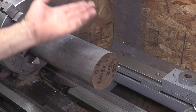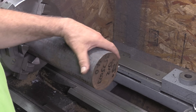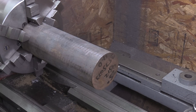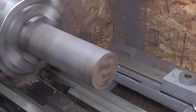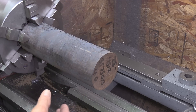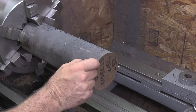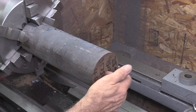This was dialed in to within about 15 to 20 thousandths. It's not really round. Give it a little turn here and that actually looks pretty darn good. We're not going to do any heavy machining — we'll take off about a quarter inch total for about three quarters of an inch. We'll face it and put a center hole in it.